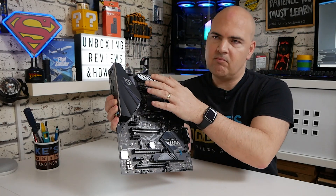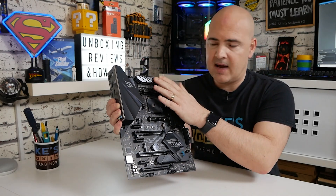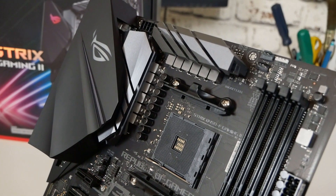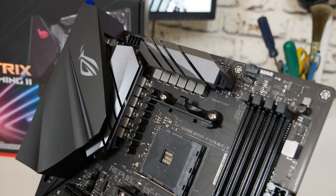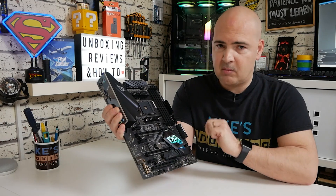This is a virtual 12-phase VRM — 8 phases for the V-Core and 4 phases for the SoC. The actual chips, conductors, etc. are detailed in the video description. They're all pretty high-quality components; the chokes are all metal and solid. From other reviews I've seen, they do work particularly well. Bear in mind this is a B450 board — power requirements back then weren't as dramatic as now, but they've done a fantastic job dragging this board into 2021.